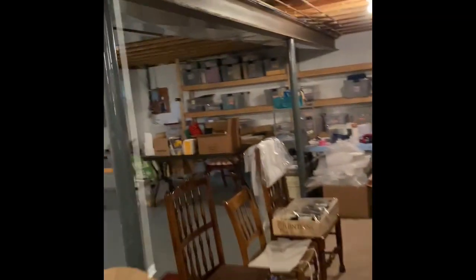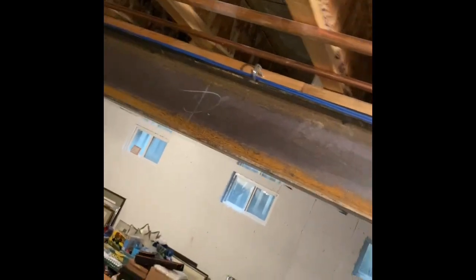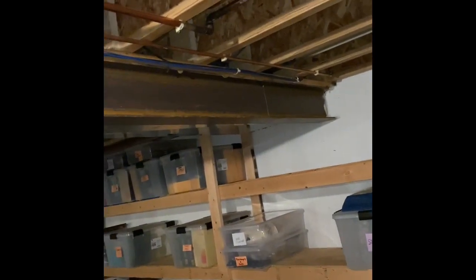There was one more down here that comes right off the top of the ductwork. It comes right off the supply ductwork and goes directly upstairs — it's on the very end over there. That one will go straight up to the second floor. Everything else will have dampers installed.